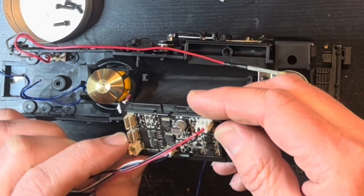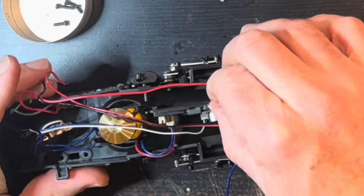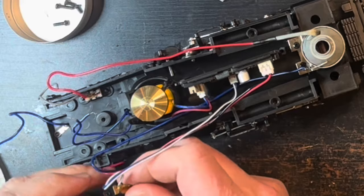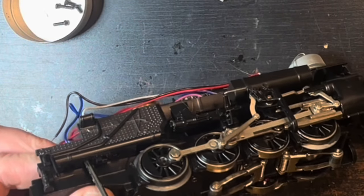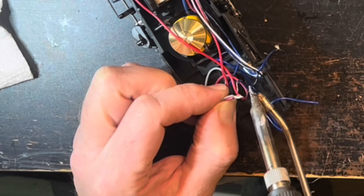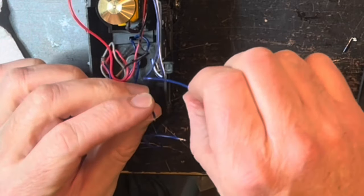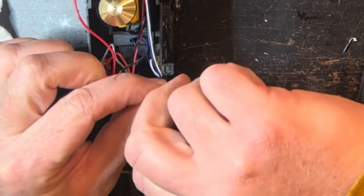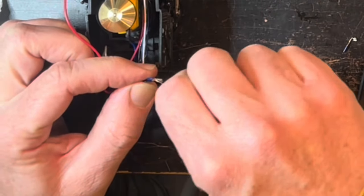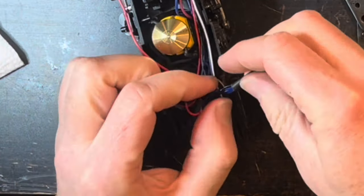The motor, the rear lamp, the front lamp. Plug the motor in and snap the board into place — it doesn't snap so much as it just sits there in that groove. Before I attach the wires, I'm going to secure the switch for the reverse lockout. One blue wire coming up from the ground, a blue wire going to ground the smoke unit, a black wire going to ground the board, and the blue wire that is the additional ground to the tender.